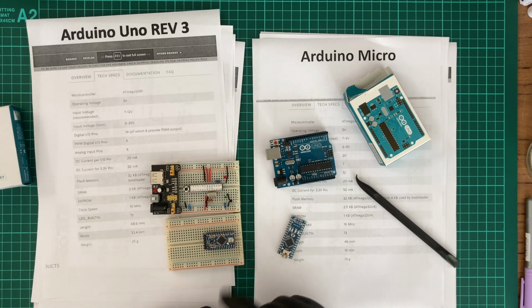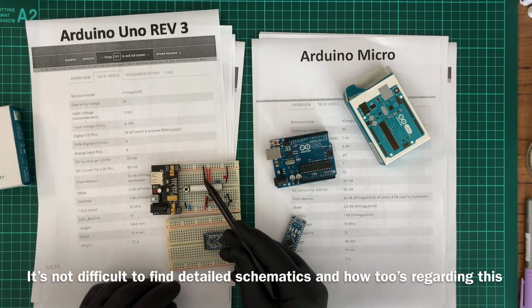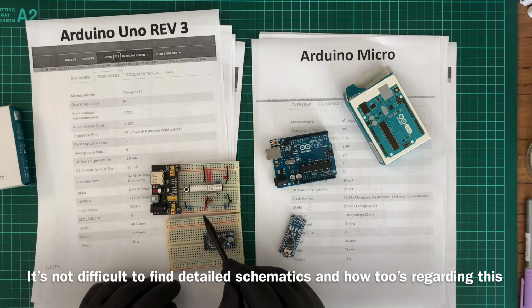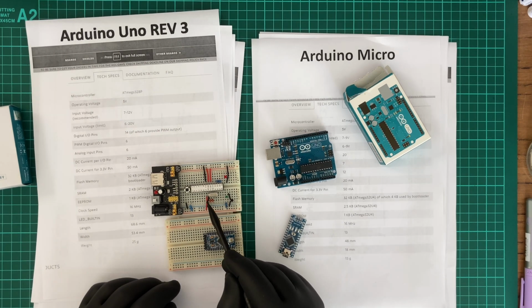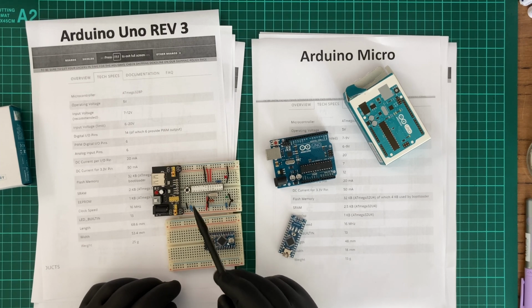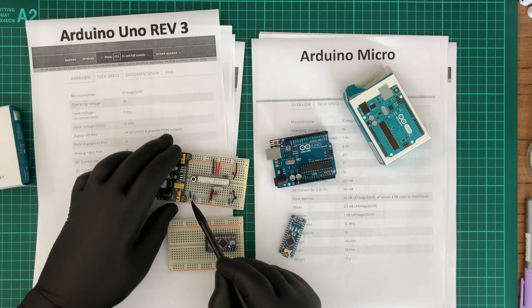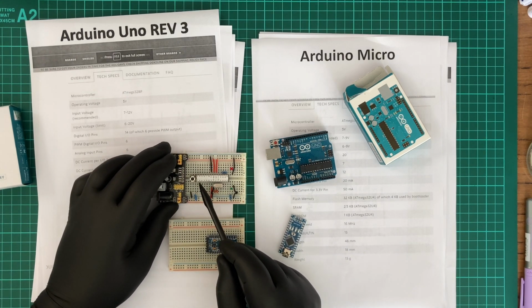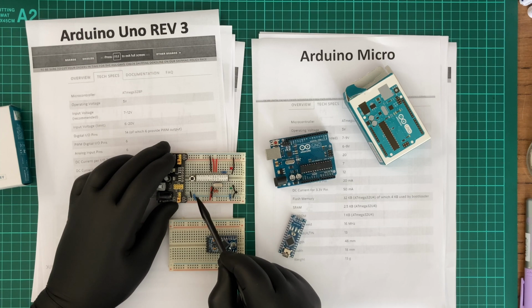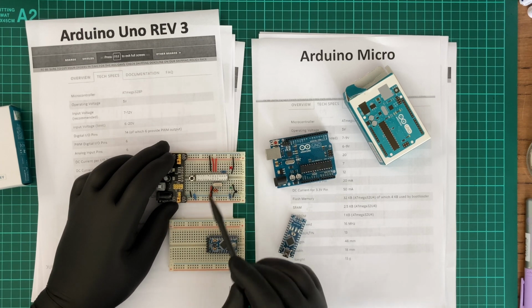But to finish off, this Arduino basically shows you what has to be connected. So ground, two positives. Over here you got one positive, one ground, which is just the 5 volts. The thing that really got me was this, which is the reset line. Now I forget what resistor this is, but effectively it has to be connected to active all the time, otherwise the chip just sort of freaks out.